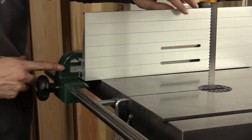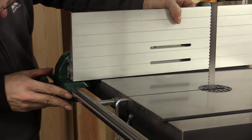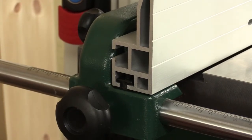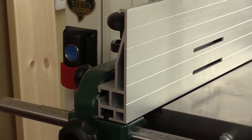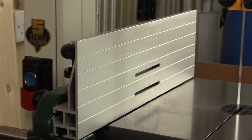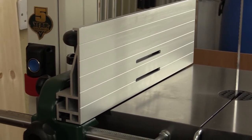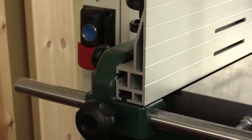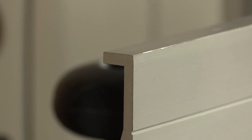Just to make sure the rip fence is mounted on that, and also over this extrusion here, more or less with the back of that, I would think. I should just point out, I've fitted the fence, as you can see there, in what you might call the normal position, but the one problem with that position is if you need to lower the guides down for thin material, then that fence is too high. So it's also possible to take that fence off from that position and lie it flat on the side now facing towards us, and then this little piece there will become the new fence for very thin material.